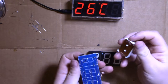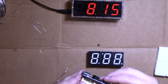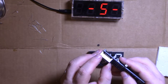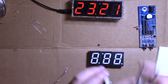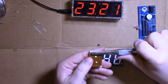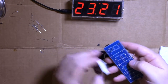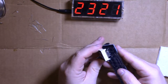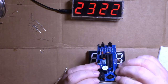These are a pain. They are very tightly fit in here. And if you put them in at an angle, you'll never get those top pins in. So you have to put them in straight. Here's what I do. It helps a little bit. Just take some long needle-nose pliers and grab all the pins at once and twist just that much. Okay. Dots down, dots down. Put it in there. And then you get it in straight and then you push it in.